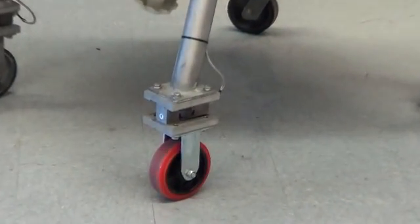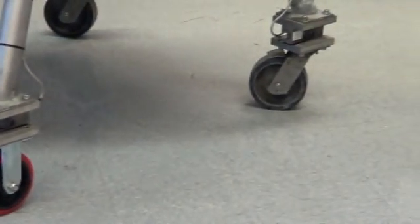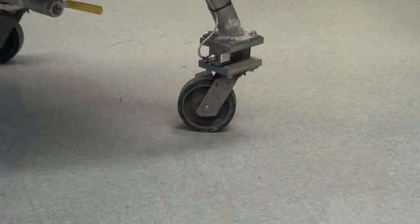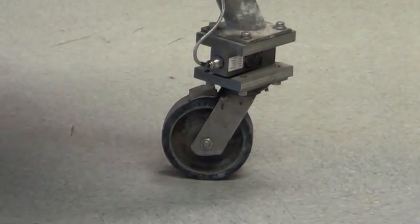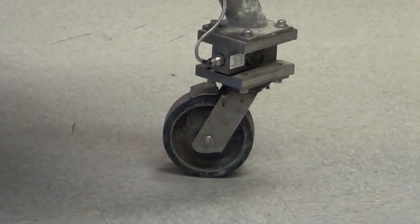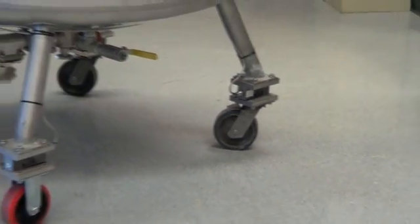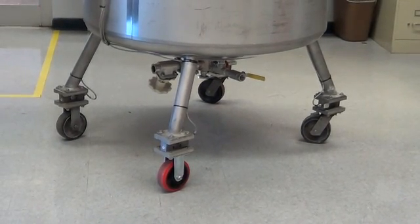The cells are moment corrected for the caster mount to compensate for a swivel caster. Notice swivel casters have an offset wheel, which creates a pinching action on the load cells. Standard load cells only take vertical forces on the y-axis. The moment correction compensates forces on the cell from other than the y-axis and only allows the forces in the y-axis to be felt.